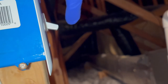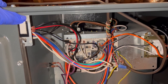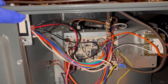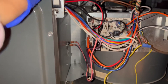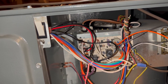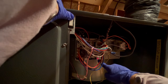After I replaced the door switch, my thermostat turned on and my furnace also started working again. You can hear my furnace turn on when I press on the door switch. You can also look to see if the red light turns on when I press on the door switch, which would indicate that there is power going to the circuit board.